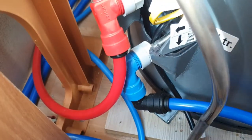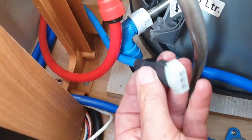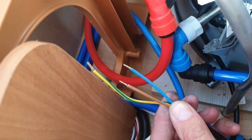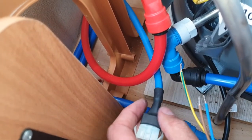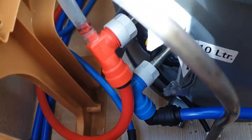Tighten up and double-check, but don't over-tighten them because if you break them you've had it. Shut the dump valve off. The new element wire only comes like this, so I'm going to cut it off, put a spade connector on there, and seal them up well out of the way of any water leaks. And that's it - fill your tank and give it a go.